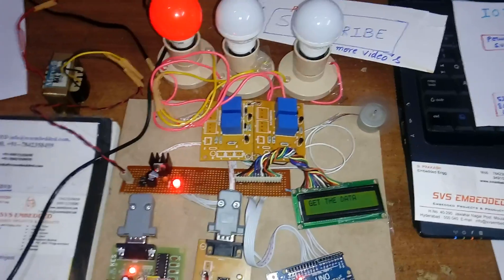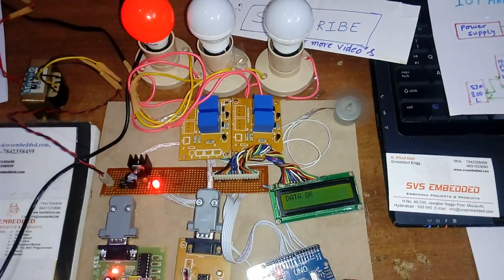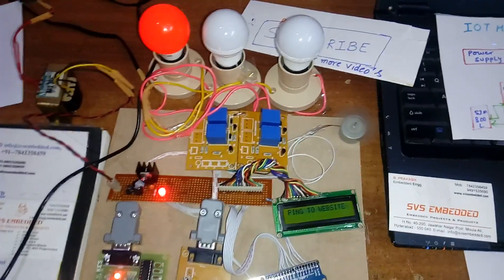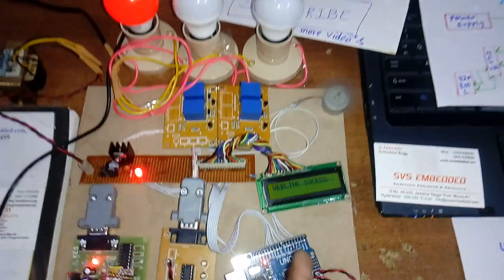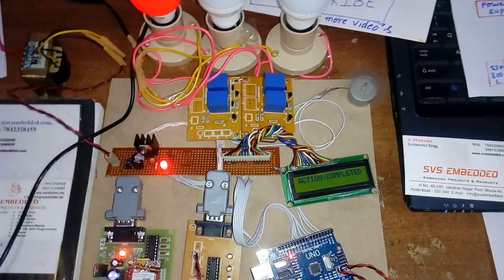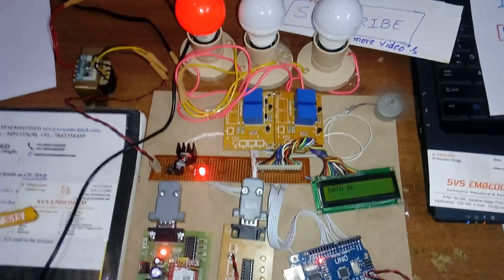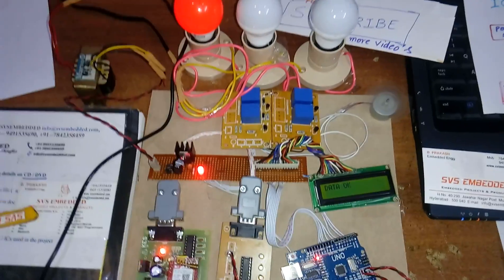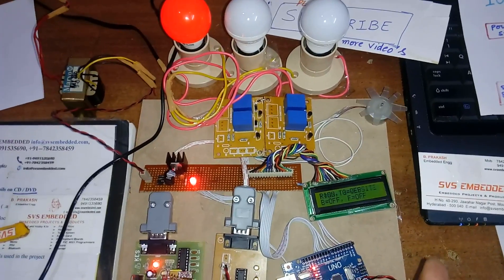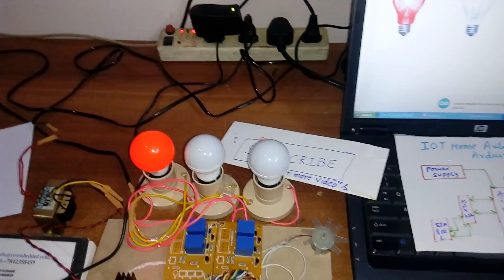Now I am going to turn off the fan. We will see action completed — it should respond very fast. The fan should turn on momentarily, then off. It will ping, action completed, AT+HTTPACTION data will be received, and it will check the data. Fan should be off — yes. Red is on, and now I am going to turn off the red.